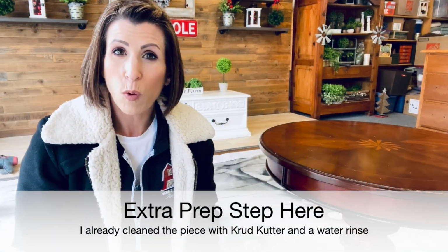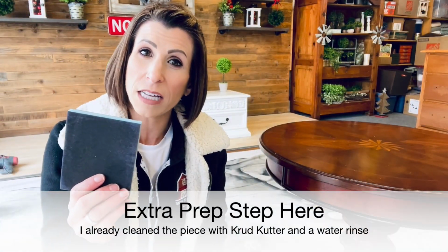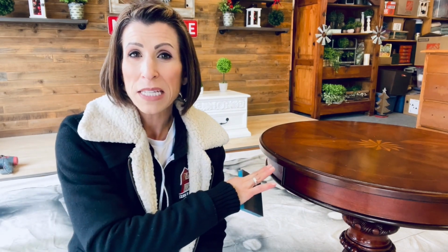So I'm going to take one extra step here. I'm going to go ahead and scuff sand my piece. This piece in particular has a really shiny, slick feeling surface. So even though I used my deglosser, degreaser cleaner, I want to go ahead for best adhesion and make sure that I don't have a super shiny, slick surface.